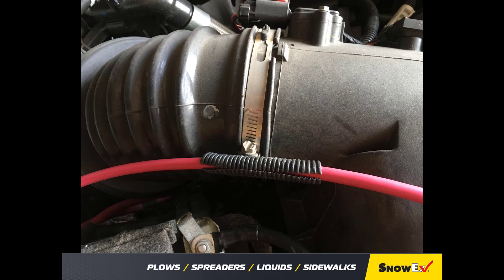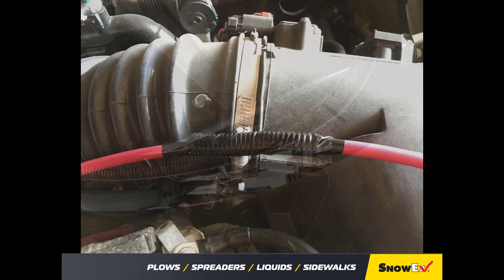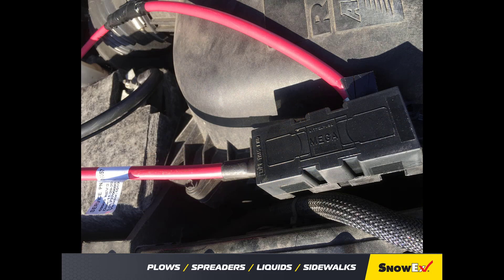If it is unavoidable that the cable is touching a metal surface, chafe wrap it to prevent it from grounding out. Finish the battery cable installation by attaching the other end of the 22-inch cable to the positive post of the battery, then run the vehicle harness up through the engine compartment from below and attach the red lead to the other end of the fuse holder and the black lead to the negative battery terminal.